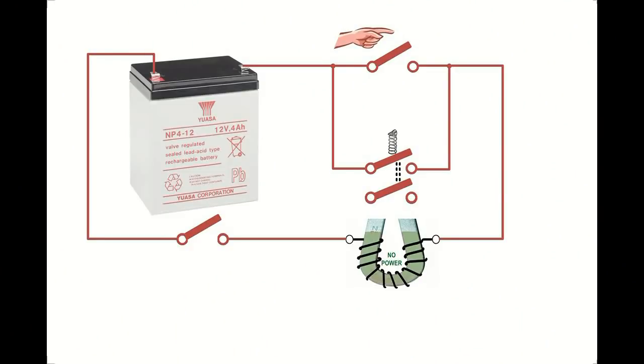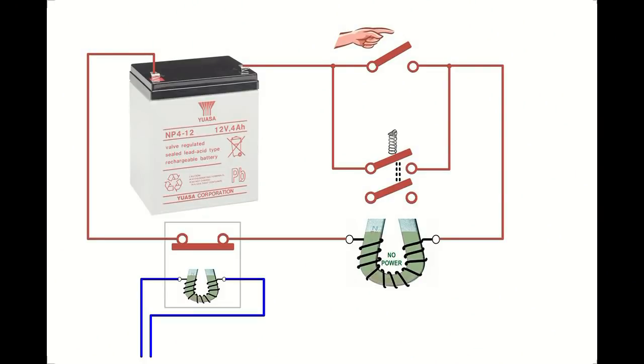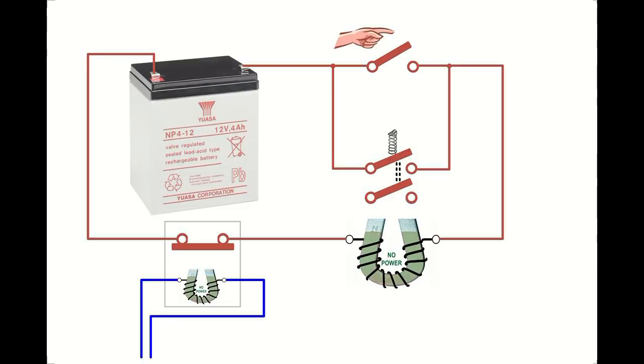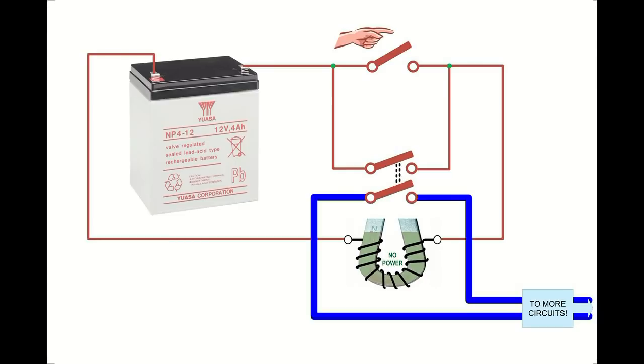So now a separate circuit has to control the unlatching, and we're going to use another relay. This relay is used to unlatch the first relay. You can see how complicated these relay circuits can become. Nowadays, this is all done by microprocessors. The spare switches on these relays can be connected to anything. In an old lift motor room, these relays form part of the call logic.